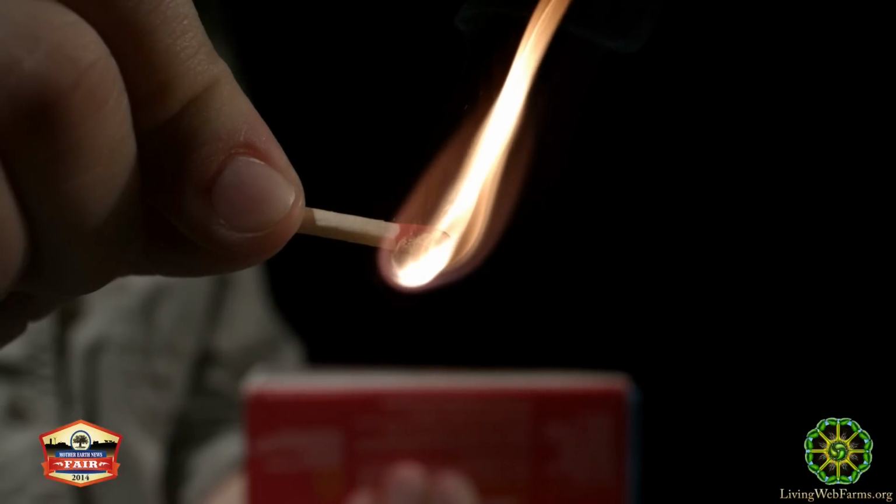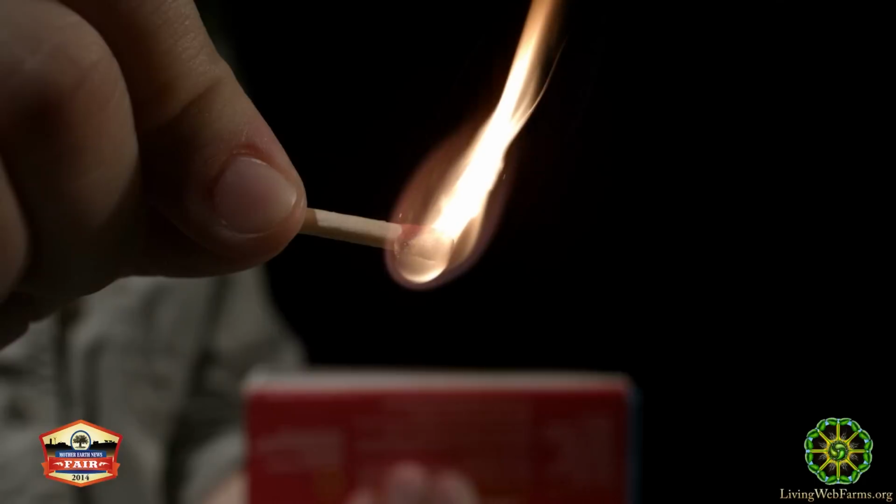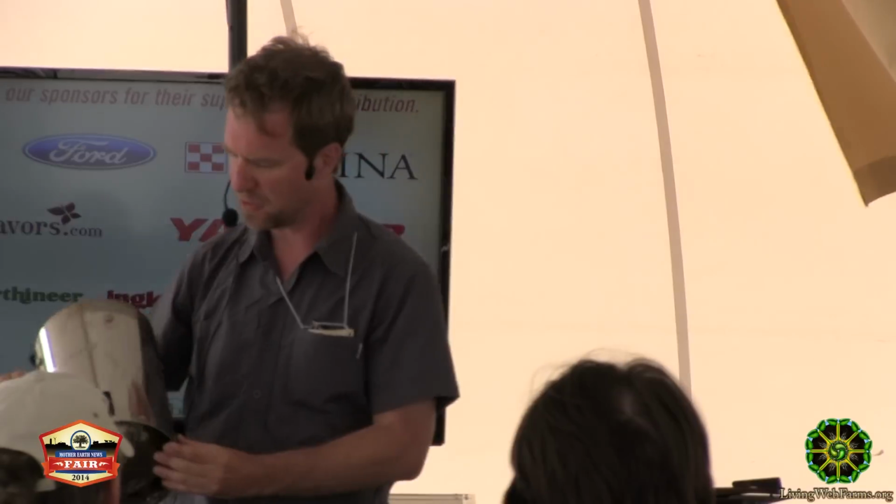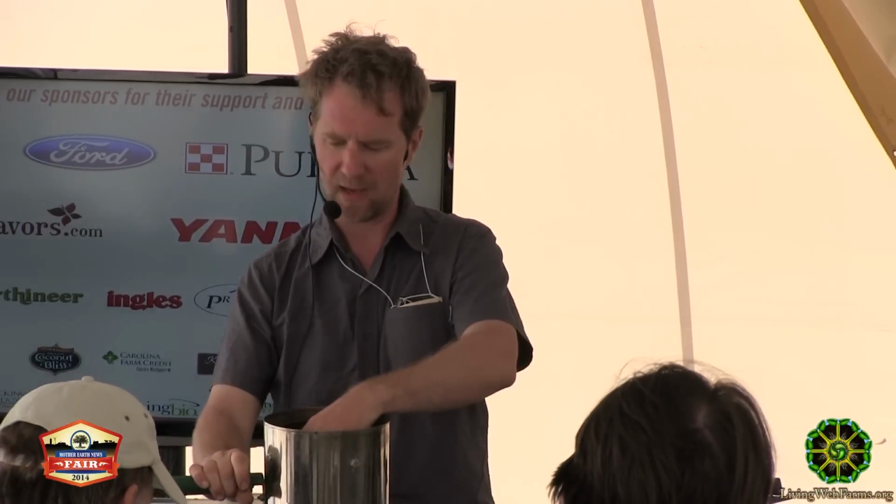And if you keep holding that wood match horizontally, what happens? It keeps flaming, the gas is driving out of the wood, and then eventually what you're left with in your hand? A horizontal, thin stick of charcoal. That's what we're doing here. You're letting in just enough primary air to create just enough combustion, to create just enough heat to pyrolyze the wood chip into wood gas. And that wood gas starts streaming up that central cylinder.